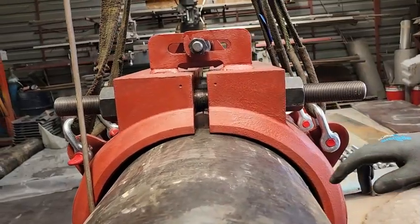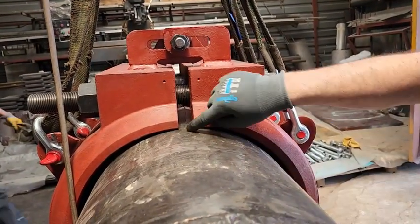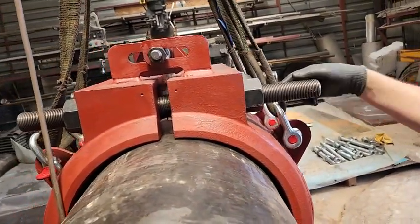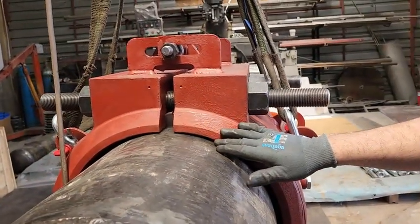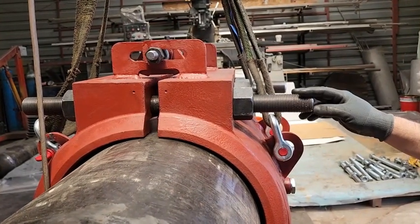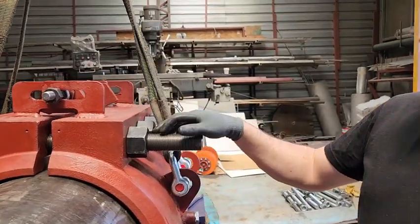Optionally, depending on preference, the shown areas can be welded. Since these are different materials, the welding wires must be different for the split sleeve body and different for the stud and nut, whose material is 4140. This welding also has a separate procedure.